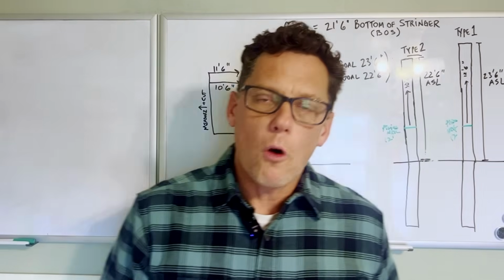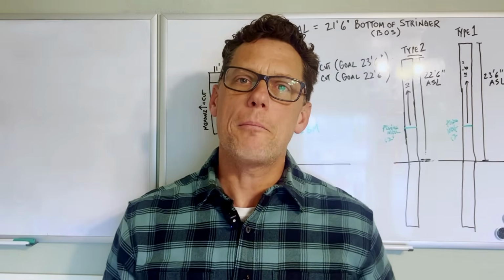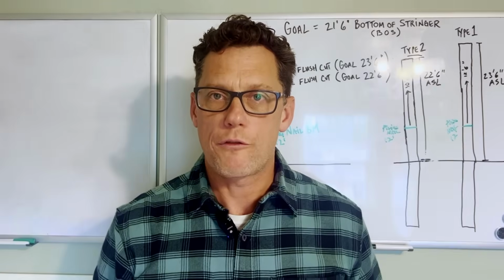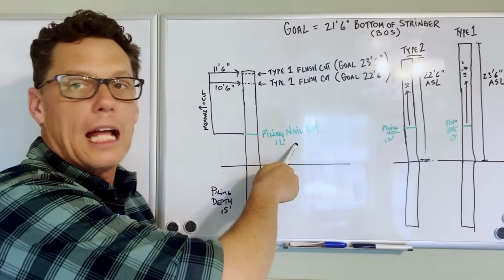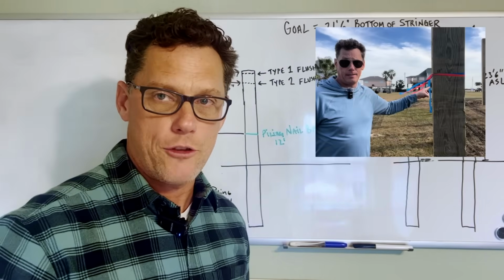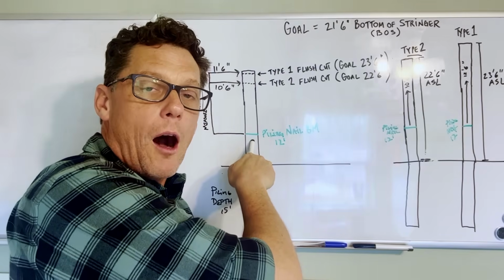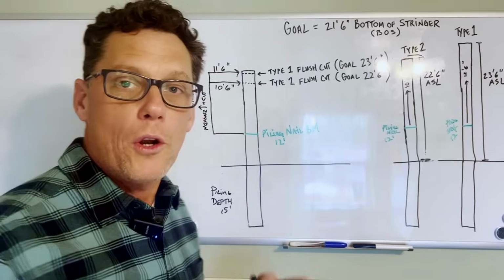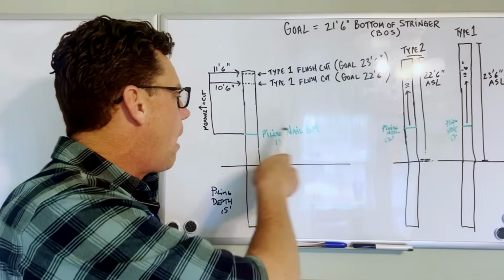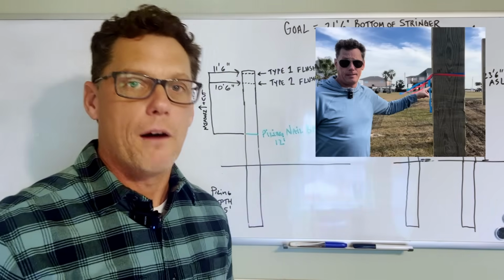In my last video on pilings, in video 1 of this series, I went through a whole slew of steps that needed to happen after the pilings were installed, but before we can start framing. So again, check out the link below to that video. And one of those things, and possibly the most important part of that, was what is called our piling nail survey or our piling benchmark. What that survey does is it gives us a fixed line above sea level on that piling so that we can measure off of. So on our piling, you will see we have a piling benchmark set at 12 foot. That means that that mark is 12 feet above sea level.